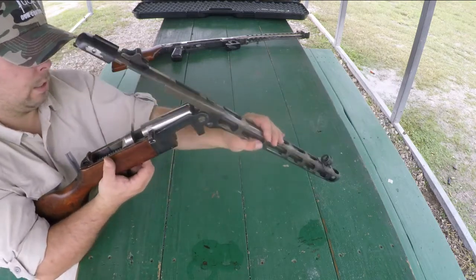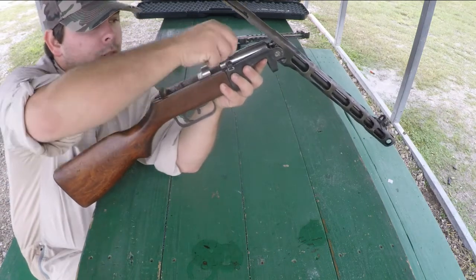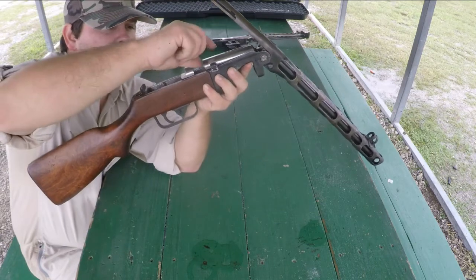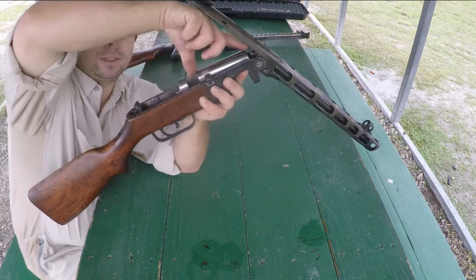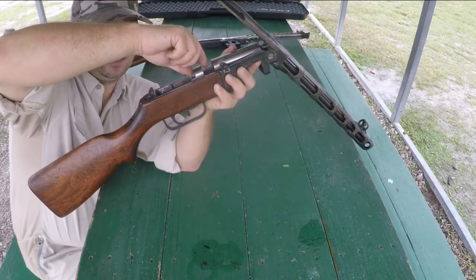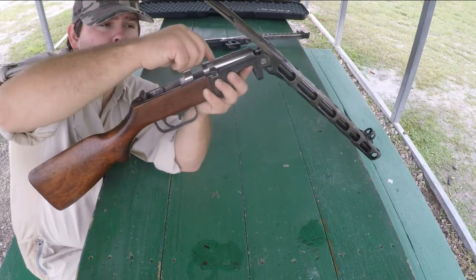Now for this one here, I am going to be doing a true striker fire. So what most people do with these kits is they call it striker fire, but in reality it's a linear hammer. So cut the bolt in half like so, and in this front half of the bolt they'll do a retained, spring-loaded firing pin. And when you cock it back, this part of the bolt here has the catch that catches on the sear, and it will stay in the backward position while the front of the bolt goes forward.